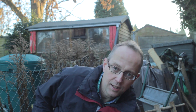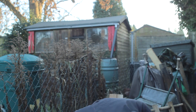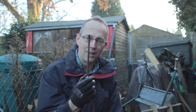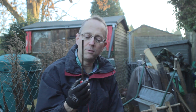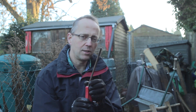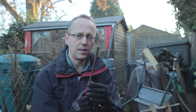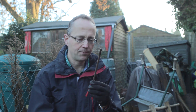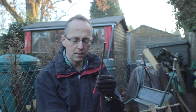And the other thing you need is a sacrificial electrode. And all that is is just a bit of old bar, a rusty old nail, any old bit of ferrous metal. Probably best not to use stainless steel and not to use a zinc coated item. If you just use ordinary soft iron, anything like this old bit of bar would do the job perfectly well.